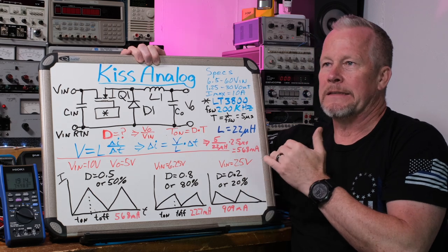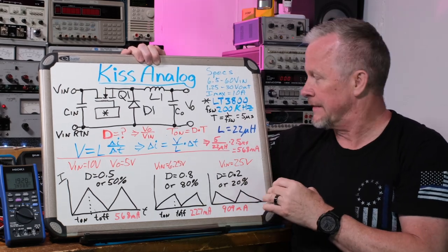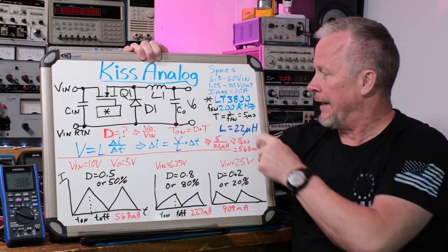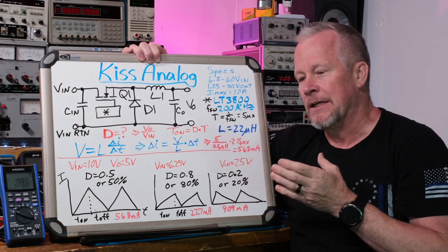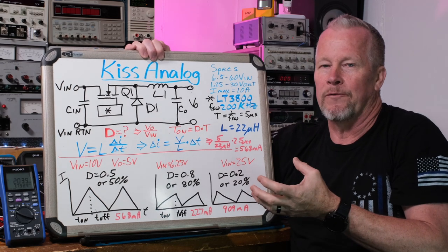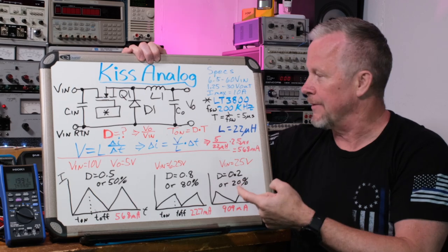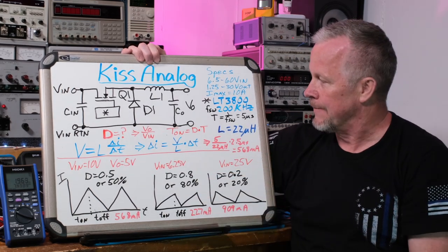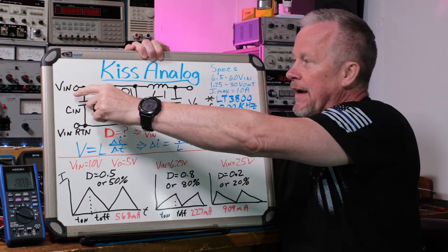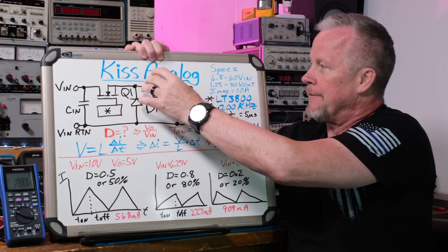Let's say it drops 10% - maybe it's only 20 microhenries when you actually have it loaded. Depending on how much current and what kind of inductor it is, that can drop even more. If you put too much current through at the peak, this inductor can actually saturate - it's like a sponge. You can only put a magnetic field into it so much. Keep putting current in, the field builds and builds until it can't hold any more. It's like a big old sponge - you pour more juice on it until it just runs all over because the sponge is full. Then the inductor just shorts, all the current goes to the output, and that can damage whatever circuitry you have downstream because you now have 25 volts straight through.